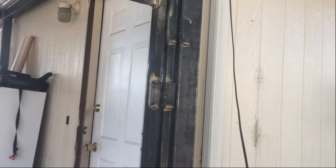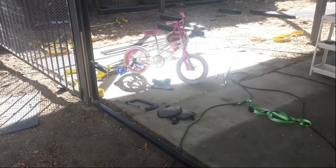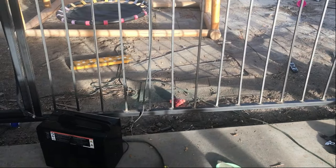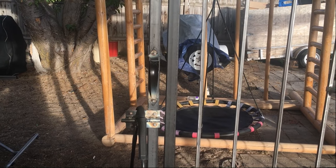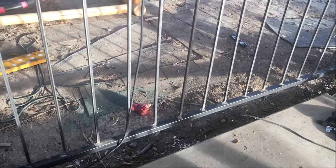Here's where I'm going to have the door — this is just going to be one other gate and you can see how it hinges in two places. I've got most of the poles up and tacked on one side. I need to go back in, straighten them out a little bit, and tack them more. We also added a little lock mechanism and a handle so that we can open it from this side.